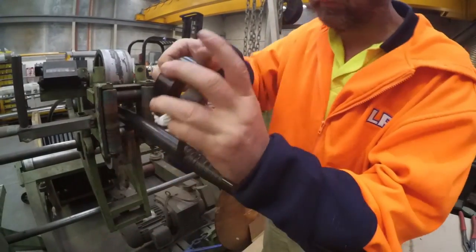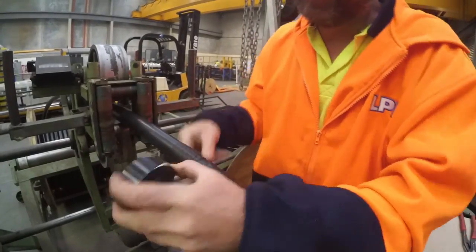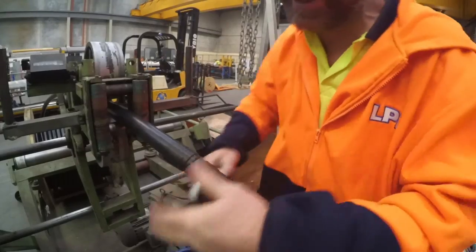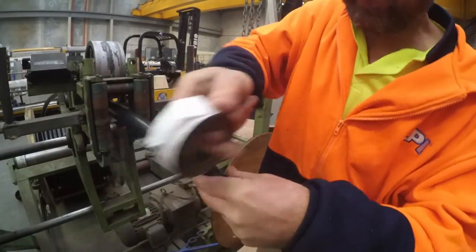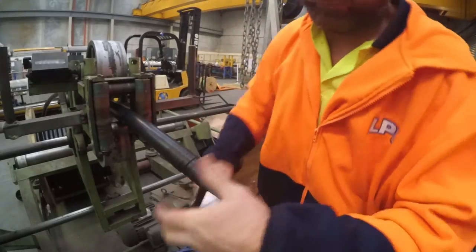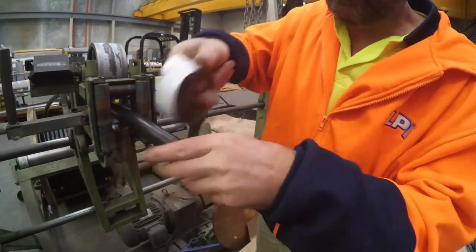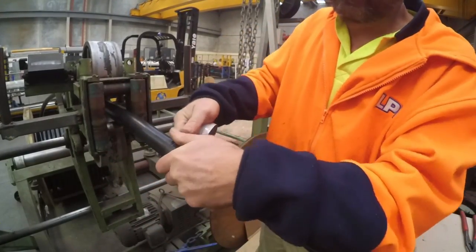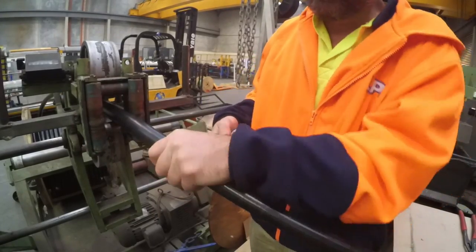Overwrap back towards the crimp end of the cable, again stretching the tape with 50% overlap, leaving 5 cm covering the outer copper screen tape and the black insulation and 3 cm covering the black outer sheath. This should use approximately another 50 cm of the tape. Wrap another 2 layers, again stretched with 50% overlap, back up to where the black outer sheath ends to build up the cable diameter and to smooth out transitions in diameter. Cut the tape and press down firmly to ensure it amalgamates with the tape below.